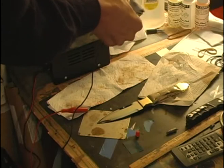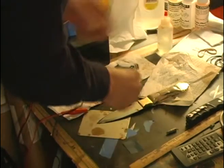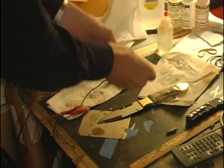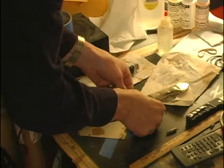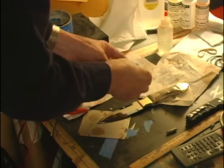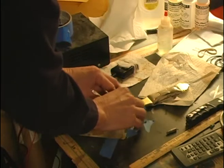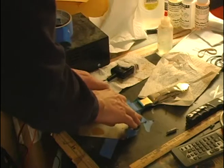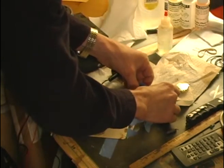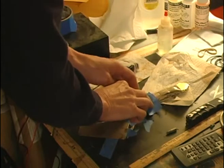You don't really want it dripping wet, just nice and damp. I use masking tape to put my stencil where I want it on the blade. Make sure it's pretty straight, and I'll also put a little tape up here. You just want to make sure you don't have any area uncovered where you might accidentally etch where you don't want it, because it would make a dark spot on the steel or the brass.